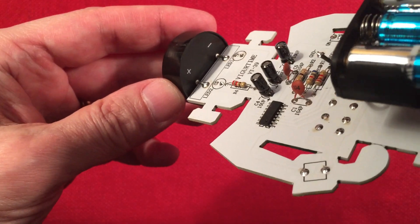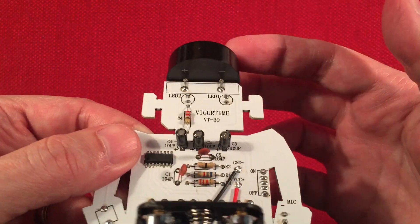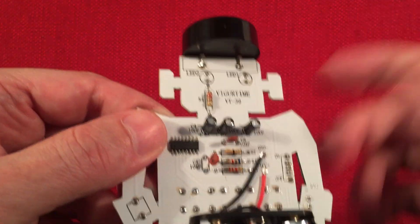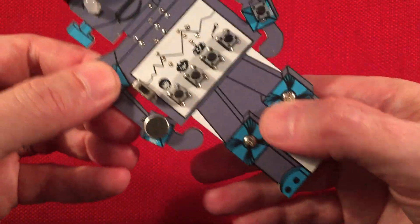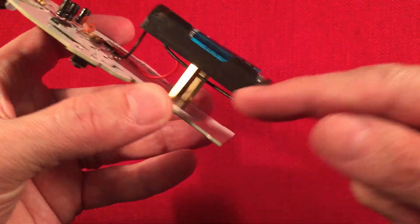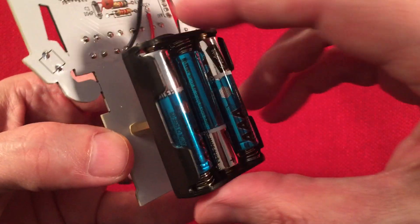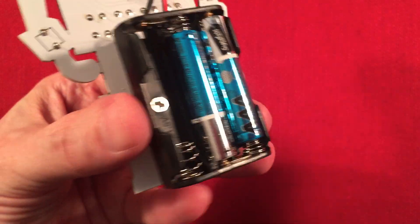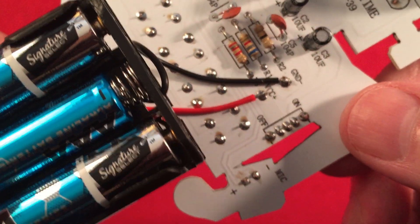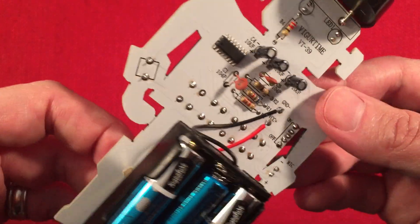The speaker has a polarity mark — the picture showed the positive coming to the left-hand side from the back, so that's how I did it. You fill a little solder on there and then hook them on — that simple. The battery bay is very simple: two brass standoffs, use the round screws on the front like the kneecaps, and the battery bay is held in by two flathead-style screws that go into those brass standoffs. Three AAAs go inside, and then you solder the positive wire to VCC plus and the ground wire to ground.